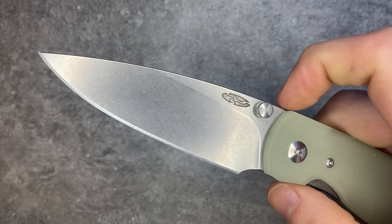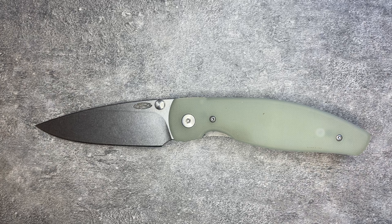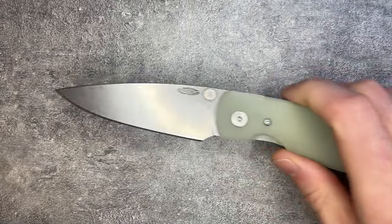The fact that they use a relatively gradual flat grind, and then they put a very good stonewash on there that knocks down this little plunge edge, it ends up being a very effective little slicer. If they made this thinner behind the edge — which you can do with a sharpening or regrind — the edge would be a little bit more fragile. They could make this blade super thin if they wanted to, but with the thickness they've got, it ends up being a very good balance between being as slicey as you ever need it to be while still being a knife that you can push decently hard. It's as slicey as you need it to be, and probably slicier than you need it to be.